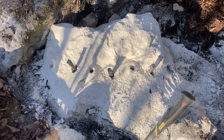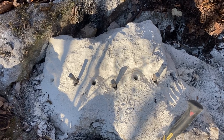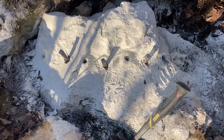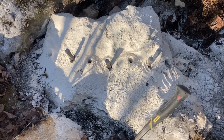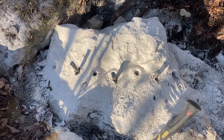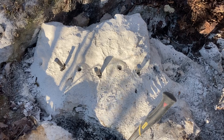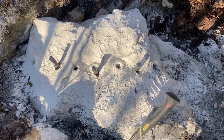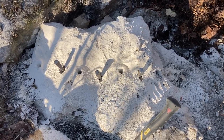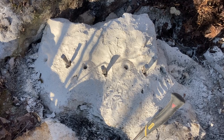Yesterday when my daughter and her boyfriend were doing a bit of this, a couple of times the drill bit got heavily jammed and we didn't know if we'd get it out. So I ended up just pouring some water down into the hole to make a slurry. With all the powder, it was just locking the drill bit up against the sides of the rock. Good on them for giving it a try — I try not to hover, I show them how to do it and let them work through it. Just pouring water in the hole did the trick a couple of different times.